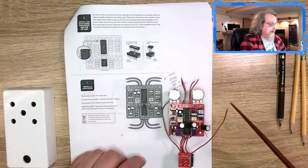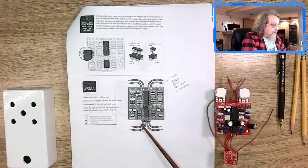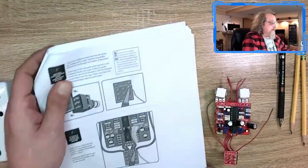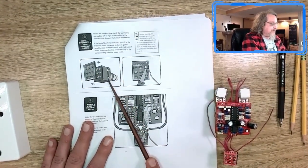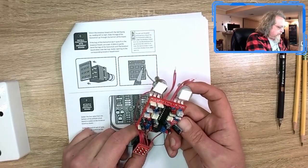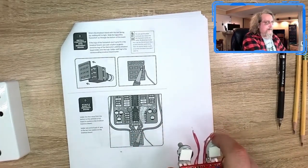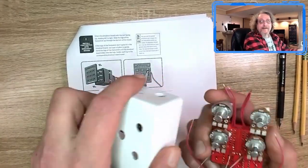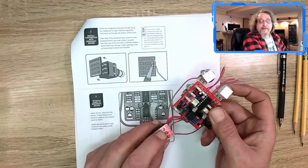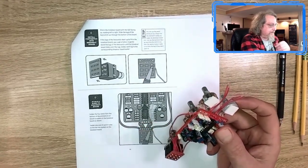So here we go, let's start. Number 6, put the two ICs in, which I did, easy, done. Part 7, solder these 8 wires on. I did, again, pre-cut would be great, guys. Step 8. So here's something interesting. It's soldering the 3PDT switch on. One side says this side down, and they don't say which side they mean down, like down like this or down like this. So I looked over the picture and figured it out. Then I soldered that on. I need to clean it up. Yuck. What is it with this modern flux solder? It's sticky. Got to clean it up and do that next.